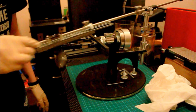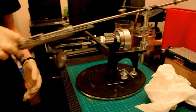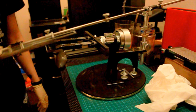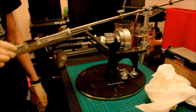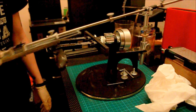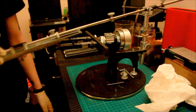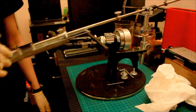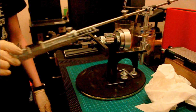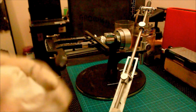And what this is doing as well with 1000 grit is you don't really need to strop the knife after you finish sharpening when you've gone this far up the grits. It leaves a perfect edge as soon as you've finished with the 1000. And to get that, I'm just going to go really light now, just with the weight of the stone, just to polish that edge. And for the other side as well, with the really light pass, just the finishing pass. And that is going to be one very sharp knife.